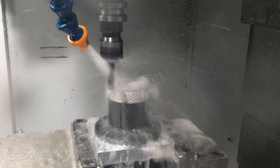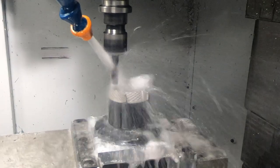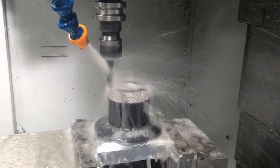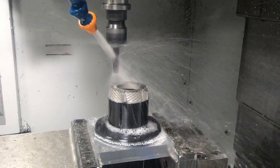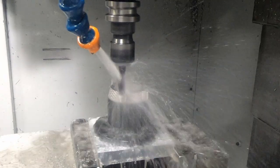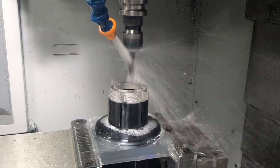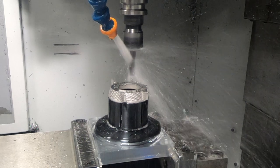The bottom has about 1mm of extra material, so I'm using a quarter inch diameter end mill to remove it in two passes, being a little conservative because I wasn't sure how rigid this setup was — but it turned out to be pretty rigid. This is the finishing pass, moving a thinner amount of material for a better surface finish. You'll see just how fast the rapids are on this machine when going full speed — both impressive and scary. This is finishing the curved part of the lug, though it didn't clean up all the way because the material thickness wasn't enough in that section — it at least cleaned up the part closer to the back.